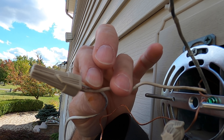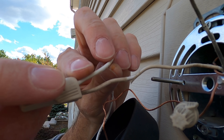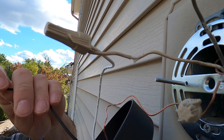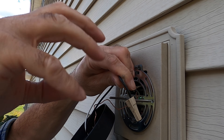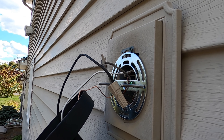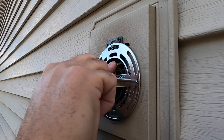So there it is — I'm going to tighten down my bracket, just make sure it's level. That way you don't have to level the fixture later. Let's go a little bit more — and you can see I'm right on. So now I'm sure when I put the fixture up it will be level. The first wire I always connect is the ground wire. You can see the ground connection there. I'm going to take the ground wire, make sure it's clean, and put it right on there. That's where my quarter-inch flat blade is going to come in. There's a little dimple on the mounting bracket and a little dimple on the top, and that's why I folded that wire over so it fits within the dimples.